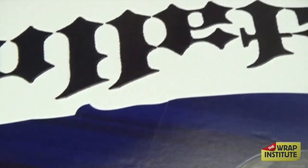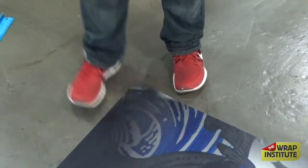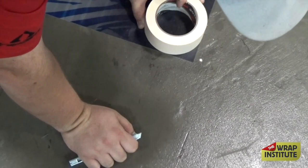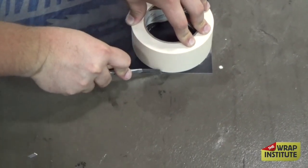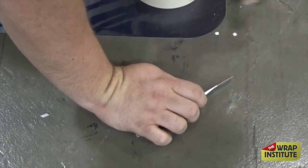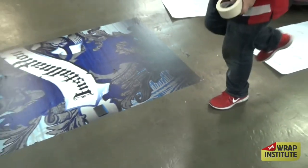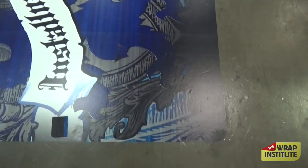The butt joint won't expand and contract over time, it lays flat — nice and straightforward. This makes it extremely durable long-term: no feet catching on it and no one's going to trip over it. A very good tip for these installations is rounding the corners. If you leave the corners squared, it's very easy for a foot to catch them. Rounding them creates a much safer adhesive edge on the floor. Adam's tip is to use a roll of masking tape as a guide to cut that rounded shape. Look how much more durable that is. Any type of exposed edges on a floor graphic, you really need to round those corners — very important. Make sure you explain that to your client beforehand, but in many ways it actually looks quite good and frames the overall look.